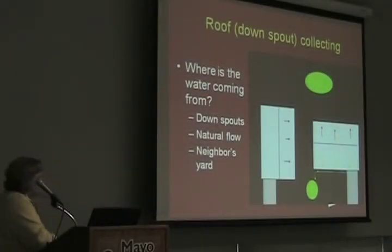Back on this slide, the one last thing I want to point out is sizing. I'm not spending a lot of time on sizes right now — I've got some resources listed on your rain garden handout that will help you figure that out. But typically, the books say anywhere from 10 to 30 percent. So if this is 100 percent of what you're collecting the water from, your rain garden should be 10 to 30 percent of that. Typically, we say about 10 percent is the minimum.